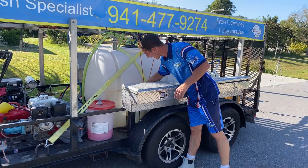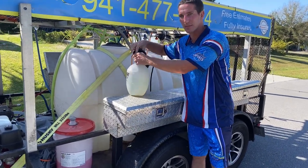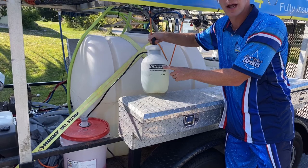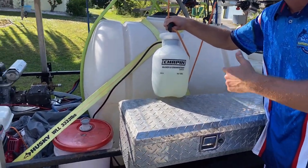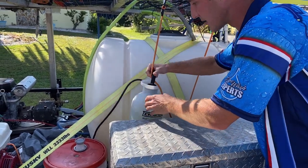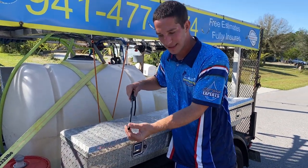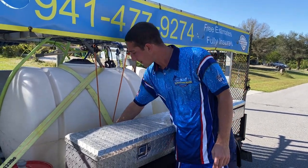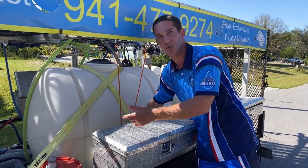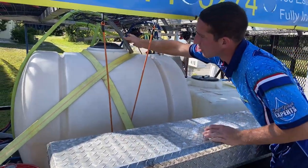I always keep little pump-up sprayers. I use these for pool cages — very precise. I've tried five different sprayers from backpack to various pump-ups. These are about $14 and they're made for bleach, so the o-rings don't go bad. Other models have metal guns that eventually rust or have o-ring failure. These have a nice swivel tip. I keep two: one for my mix for pool cages and another for Plant Wash or Agent Halt on plants.